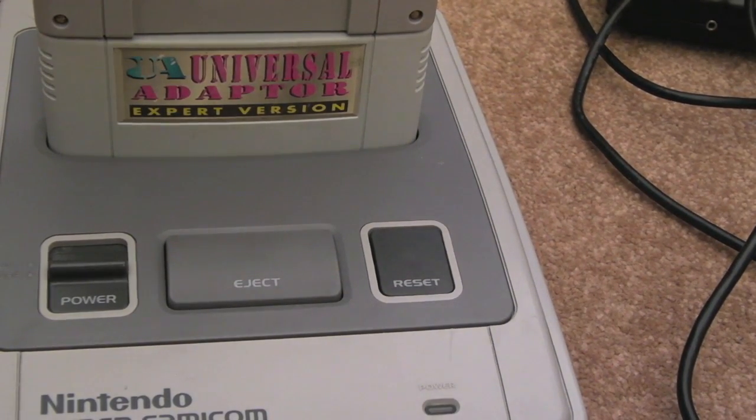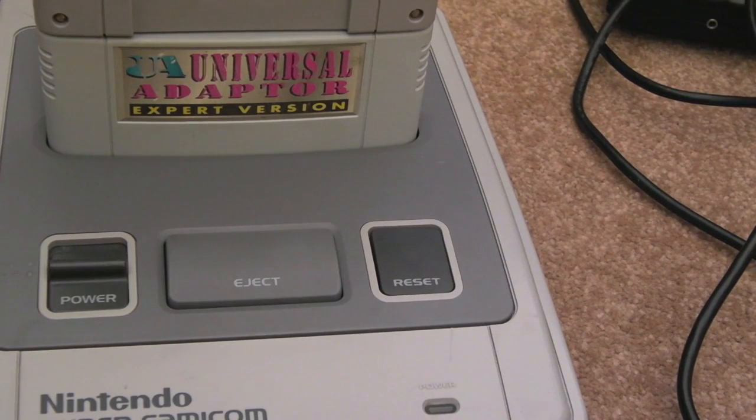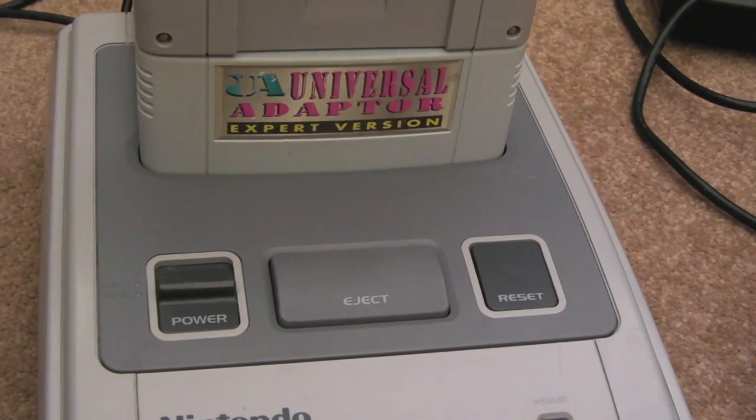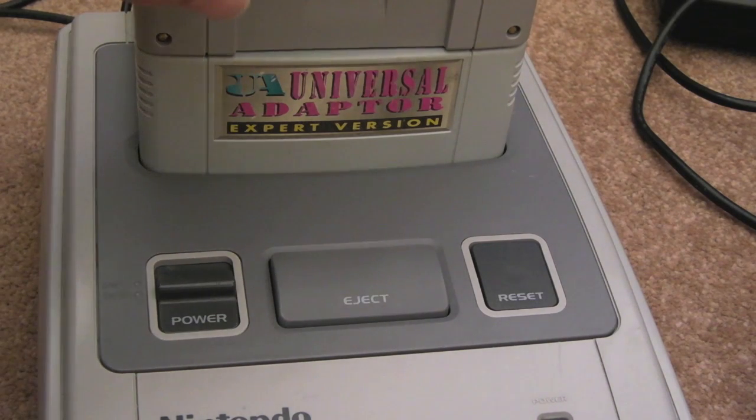I could smell, actually, as I removed them, a little bit of electrolyte there. You know, that fishy sort of smell you get. So they were on the way. Two of them actually measured okay, but one of them was a bit low. I think it was one of the 4.7s measuring somewhere like 2.1 or something. It was very close. So anyway, it needed the new caps, so I put those on, but that didn't solve the problem.